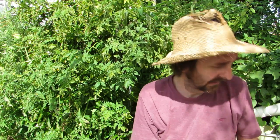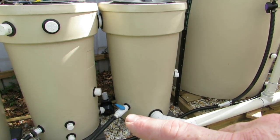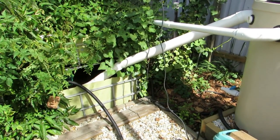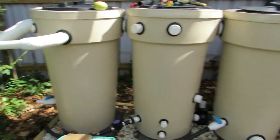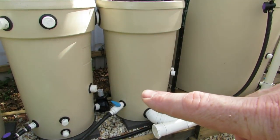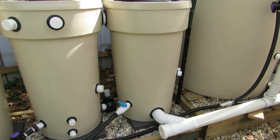I'll show you how I clean out the base of the filter - it's pretty easy really. That's the radial flow filter there, and as you can see I've got a little tap fitting on this side with a hose in it. That hose runs all the way down into the sump tank just over there, basically reducing the level of water going to waste. We're saving close to about 160 litres of water that gets put back through the system.